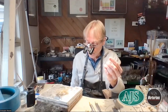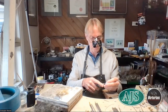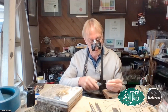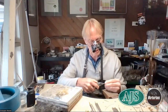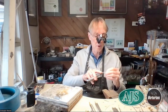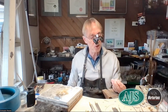And the first thing you do is you make sure that your wire is longer than you actually need it, so that you can get on with your trusty parallel pliers and give it a few twists and test your solder joint. So I'm going to do that now. I'm going to grab that wire. And what's the length of wire that we require? Probably about 2 centimeters, because we're going to end up with something around about 10.5 mils in length to be finished. Okay. That's all that you need through an ear. And I've given that a few twists, and that's given that quite a bit of tension over the wire. You want to pull it while you turn it and keep it as straight as possible. And that'll test your solder joint and give it a little bit of tension.